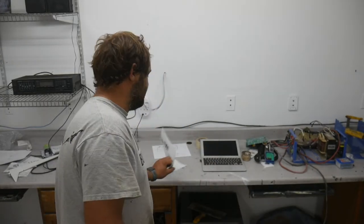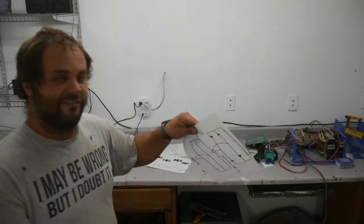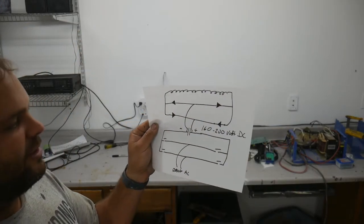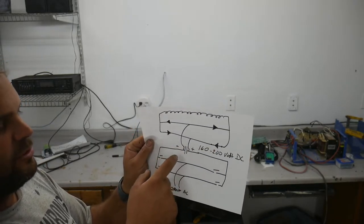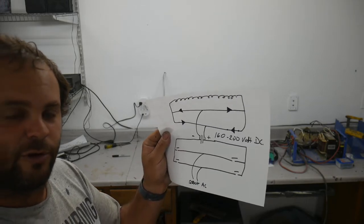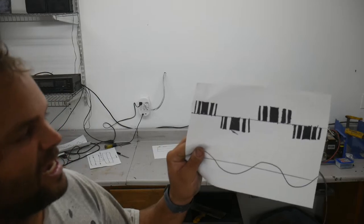By the way, a VFD is basically this exact same thing. A VFD is basically a set of rectifiers, a set of diodes, a bus bar, and then MOSFETs that the controller uses to control the motor. It puts out a sine wave like this. Obviously, the difference in a VFD is you can control the amplitude of it and the frequency of it.